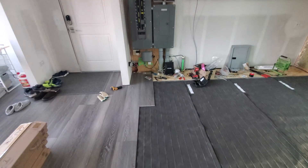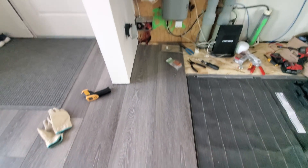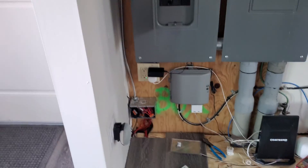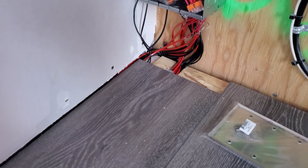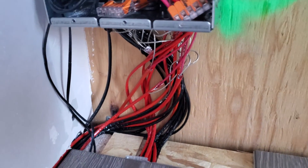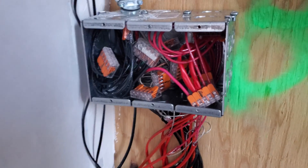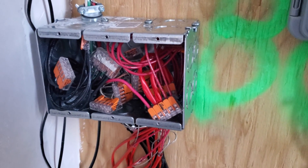Right now the thermostats are underneath this board about right here, and then they go behind the wall and up to the thermostat. All the wires are routed through the subfloor as shown in the part one video — they all come up here and go into this junction box. That's all the lead wires. There are 10 total mats in this area, so that's 20 wires, and it's quite the bundle. We've got this three-gang box here with all the wire connectors in it — it's a mess, but there's really no graceful way to do it when you've got that many wires.